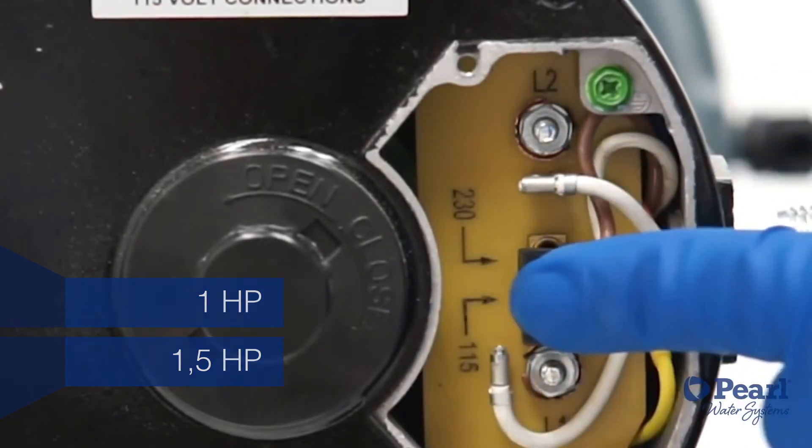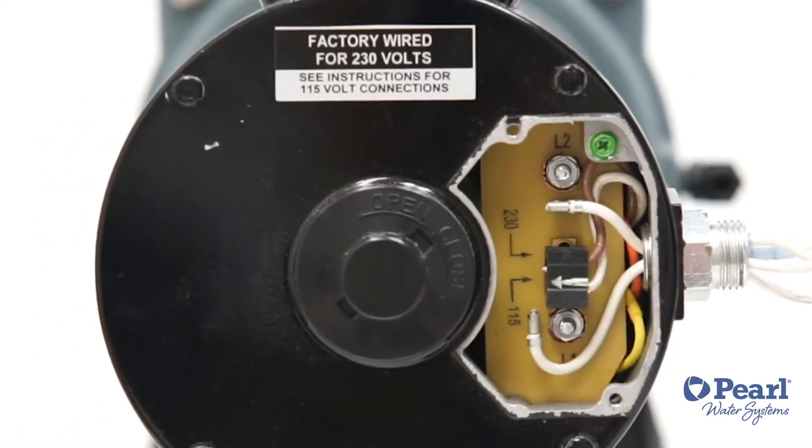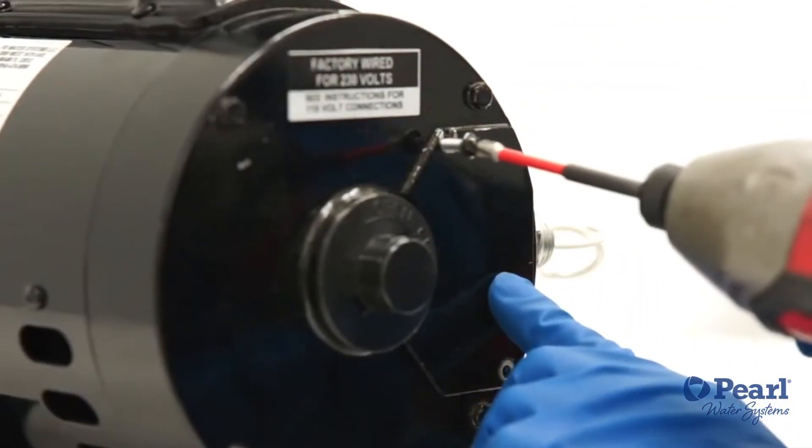While there are many other outstanding features included in the IronJet which you can find on the pump plate, most notably the motor has all copper windings and it's a NEMA ODP-56J for a much cooler surface temperature.